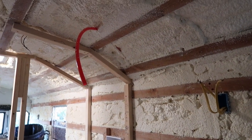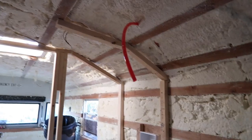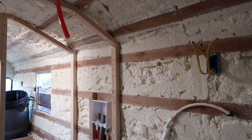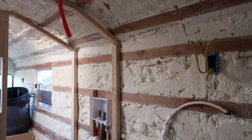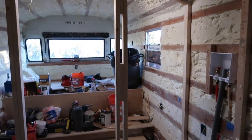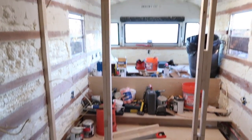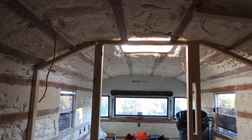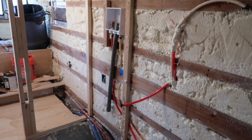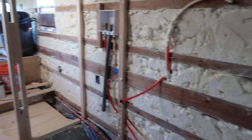I'm putting in three-inch decking screws into these runners, and it is really, really strong. I'm also gluing it with that Extreme Liquid Nails. This will be my hinge side of my door, and this will be the latch side. So it's coming along slowly. I'm feeling absolutely better every day, so that's always exciting.